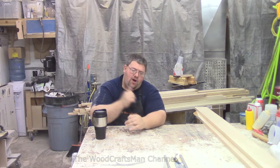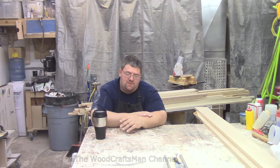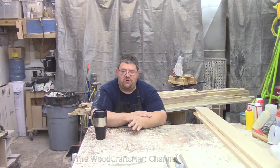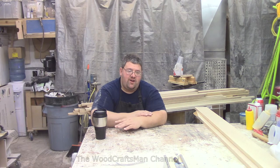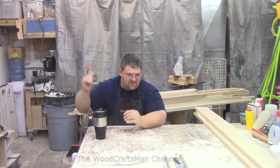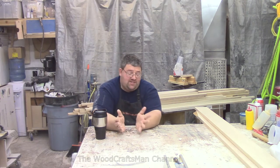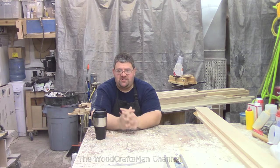Now, the panel in the shop here is pretty much covered on all 4 sides with knockouts and conduit, and he thought it'd be nice if he could replace that 100 amp panel with the 200 amp panel in its place. But I think what he's going to end up doing is leaving that 100 amp panel here and creating it as a sub panel. Then the new 200 amp panel will have a 100 amp breaker that feeds that panel, and probably reuse the breaker from the one that's in the house. But that's kind of what the intentions are.